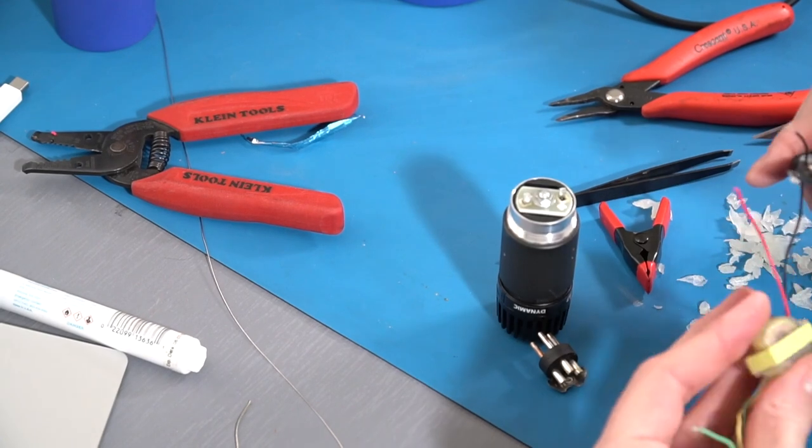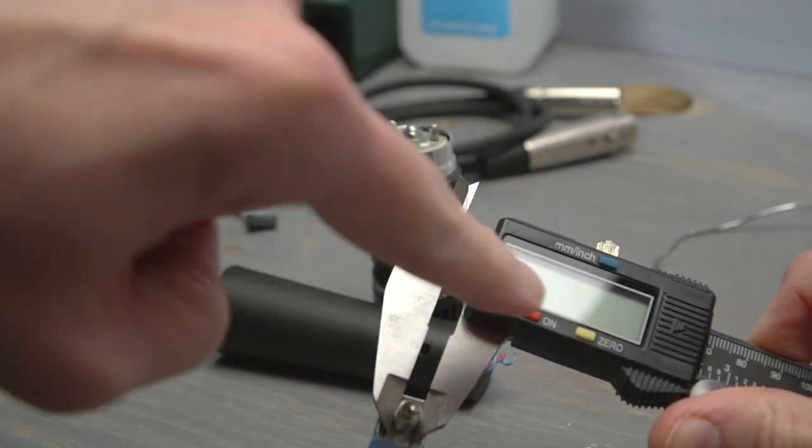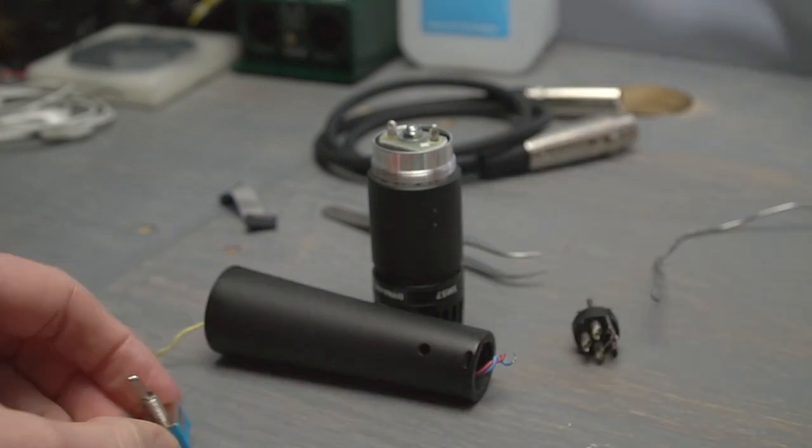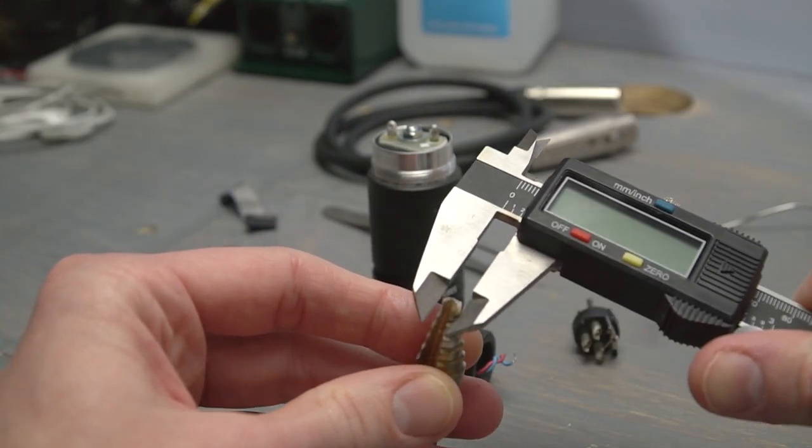We'll need to drill a hole for the switch soon. A step drill bit works great as long as you make a center punch mark and pre-drill with a small bit slowly first to avoid it slipping off of the curved handle surface.